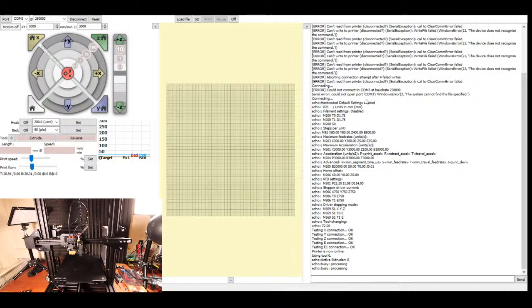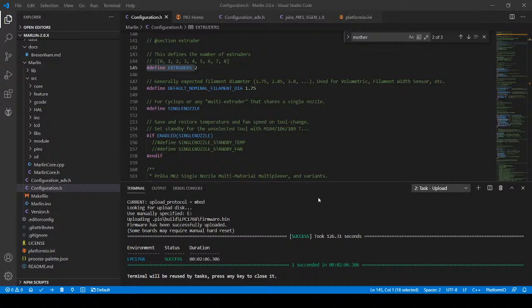Yeah, that is the BigTreeTech 2-in-1 hot end. It's a lot of fun to work with. It actually works really well. Just remember to lubricate the hot end with a drop of canola oil on each of your filaments when you put it in, and always feed forward through it. You never want to have to pull filament out, and make sure that your actual PTFE is pushed all the way down.